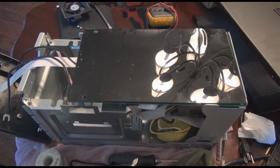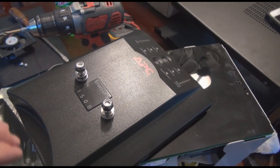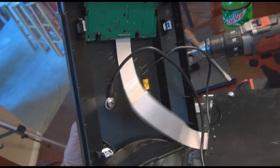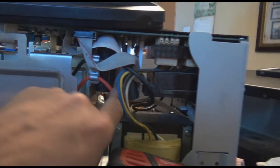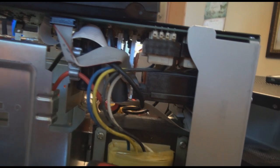Quick update: these are the two posts going to the positive and negative battery bank — I'll label them with '24V.' The yellow wire is my verified positive connection. Instead of tapping into the wires mid-run, they both go up to the board and I soldered them on top of the board. There's a little more fit and finish — they come right over the top, making for a nice, clean installation.